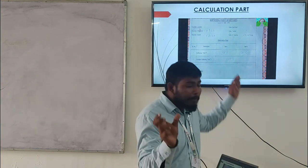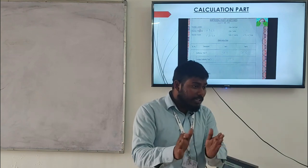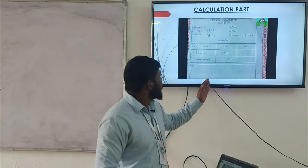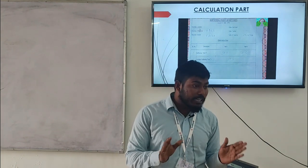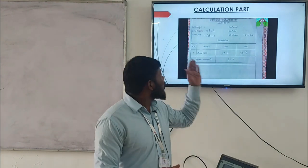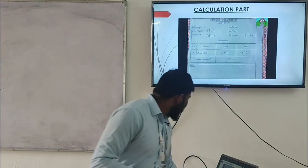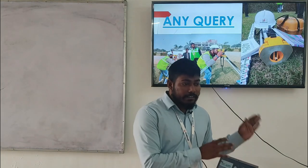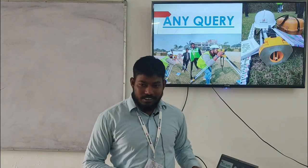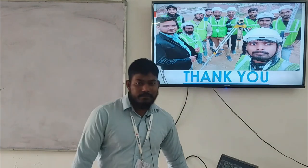So the softening point result is 50.5 degrees centigrade. If the softening point stayed below — around 48 or 47 degrees — then the bitumen would not be suitable. The main aim of performing this test is to find the softening point of bitumen and determine at which temperature it becomes too soft. If you have any queries regarding that, you can ask me. Thank you so much.